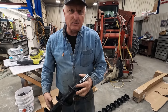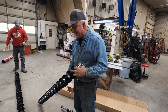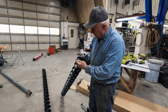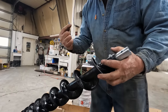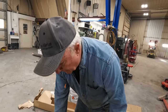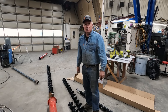Since we're dealing with peas, which are a legume similar to soybeans, if you handle them too aggressively they split. We don't want them split because we're doing this whole process for cleaning seed. So what we're doing is retrofitting our six-inch augers that come from the truck into the cleaner unit with nylon flighting. This nylon is actually cupped, so it helps throw the peas forward instead of grinding them between the flighting and the shell — that helps move the peas forward gently. We're going to retrofit the transfer auger into the cleaner, and also the transfer into the other part of the cleaner with nylon, so we should be gentle on the peas.